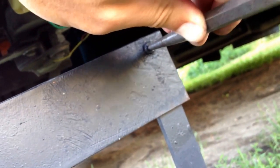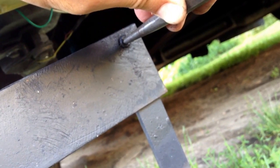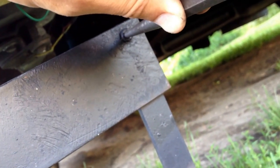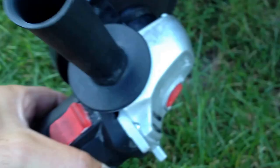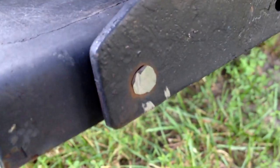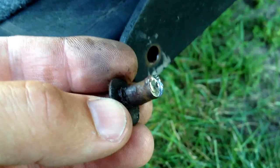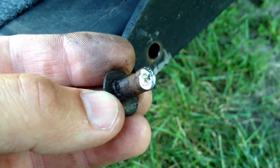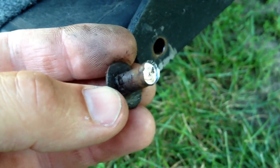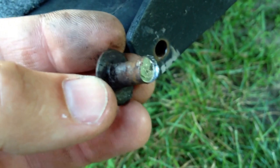Now this bottom one, the step wants to move a little bit so I may have to find a way to brace the back of it, or I may have to grind just a little bit before I punch it through. I'm just going to use the grinder with the cutting wheel on it to grind the top of this one off until I get it thin enough that I can punch it through. After grinding that almost flush with the surface, some good hits with the punch and you can see it folded that little bit down and popped right through.